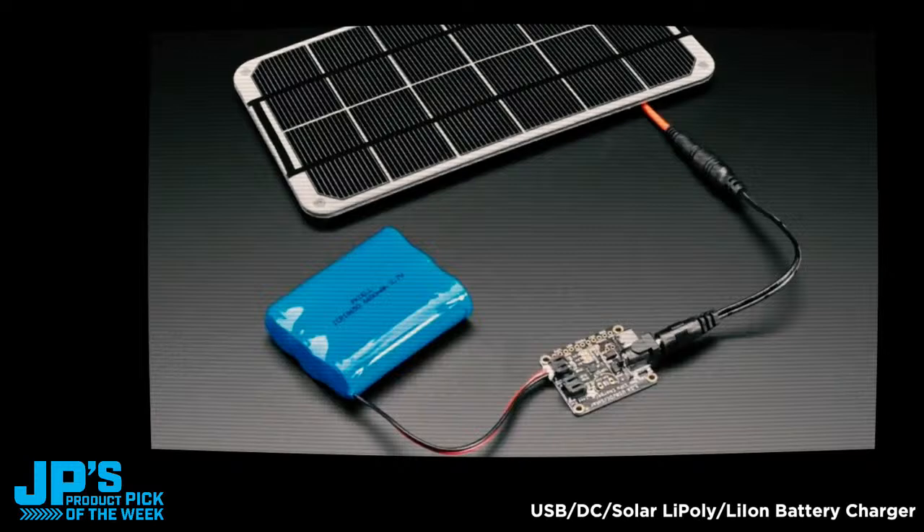Best of all, it works with solar without needing any extra capacitors. It has a built-in capability to automatically reduce the amount of charge current so the voltage doesn't collapse — it's like an input dynamic power path thing built into the charger chip. If you use a solar panel, it'll automatically draw as much current as it can, kind of like max power point tracking, before the voltage dips below 4.5 volts. So you get the most current output, nice and stable, and it doesn't oscillate. This is a great universal charger — DC power, 9V, 5V, USB-C — all works with it. It's an all-in-one everything-you-ever-wanted charger.